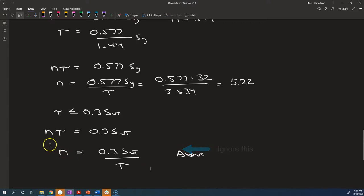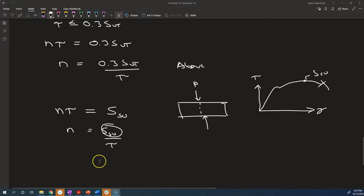I won't typically ask you to calculate the factor of safety on a weld. I might ask you to tell me what the shear strength in the fillet weld material is. I might ask you to tell me whether it's safe or compare it to this allowable stress inside the weld, but I won't ask you to calculate a factor of safety because it's not a really well-defined thing. We can come up with a convention for it, but Shigley doesn't give a suggestion for how to do so.